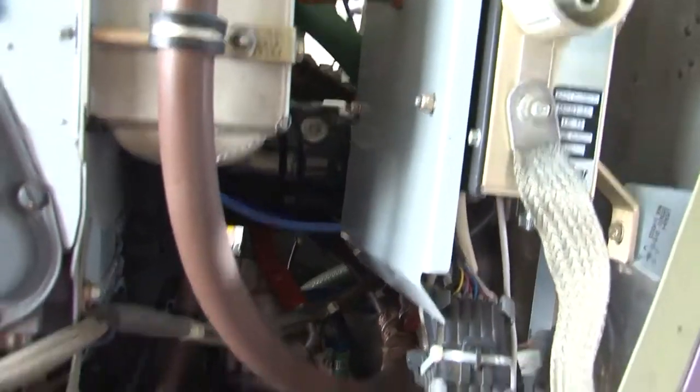We have to inspect both the magnetos, that all the leads on the magneto should be in place, they should be secured. Now you can see the wires coming out of the magnetos. You need to ensure that these wires are secured, they are not loose, and they are firmly in place. So apart from the magneto mounting, we also need to check the electrical connections from the magneto. For both the magnetos, we will do this inspection. So this is part of your daily inspection.